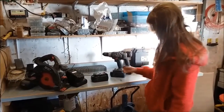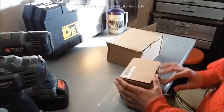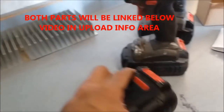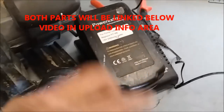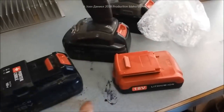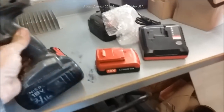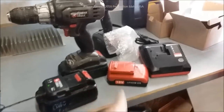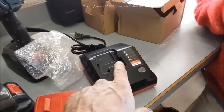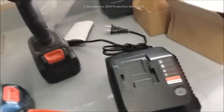After years of using NiCad, we've decided to convert all of our saws and drills over to lithium. These are batteries to replace the original NiCad batteries. There are a lot of aftermarket batteries now — this is an original Porter Cable. The replacement lithium batteries are hard to find. Down at the bottom of my video, in the info section, there are two things you have to get to convert these Porter Cables — and similar drills, saws, or grinders — to lithium without any problems. You cannot use the old charger on lithium, but this new charger can do both: it can charge lithium and NiCad, or nickel metal hydride, which was a very short-lived version Porter Cable had.